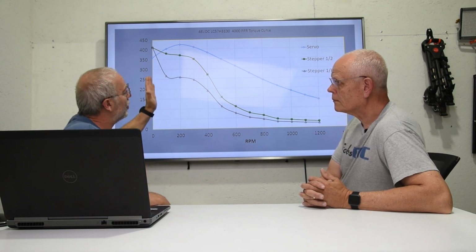And the faster your feed rate is while you're cutting, the less power that you have. If you cross that boundary where you don't have enough horsepower to drive that bit to the location, you will skip steps, right? So your stepper motor won't actually get to where it's going. And you've seen this, it'll be like a double line in your carve. Right? Because some axis is shifted, or if you actually shift both of them, you know, it'll be kind of at an angle. So the stepper motor system, we've talked about this before, is open loop. It doesn't know that, so it's just going to keep on cutting.